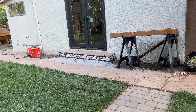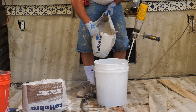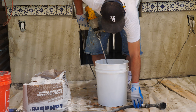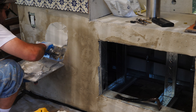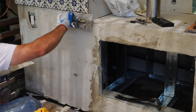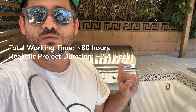Now that the tile was in, the next step is Santa Barbara smooth mission finish. It comes in a 90-pound bag and you need to get it from a specialty store. I found that cutting the bag in half works great — you can mix about half a bag in a five-gallon bucket and add a little powder additive to determine the color. If you want smooth stucco: the difference is you do not want the aggregate to come out. With traditional stucco you use a sponge float to pull out the sand, but in this case use a steel trowel. Stainless is better because rust won't appear in the finished result. It will develop micro cracks — do one coat, let it crack a little, then do a second coat and you'll have a good result.